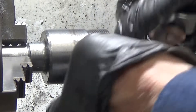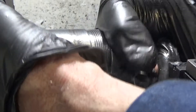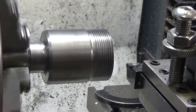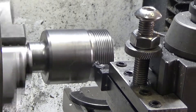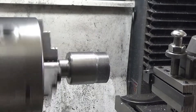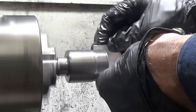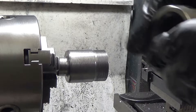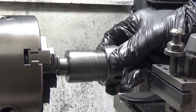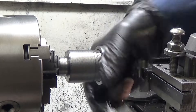Let's give it a try. It goes on but it's still tight, so it needs another pass — this is pretty much just a spring pass that cleans up the threads. A bit of a smooth off with some sandpaper also helps to get the rough edges off. And with that done — that's good, that's firm, no slop at all. Lovely.